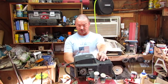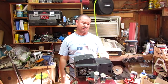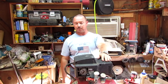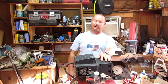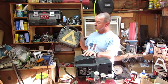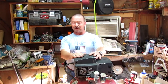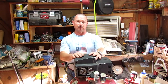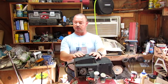And it cost me whatever the compressor cost me about 10 years ago when I got it. It was used in construction; I used it on a construction site to run nail guns and things like that. But it's been sitting for about 3 or 4 years, and I had seen videos on changing compressors into vacuum pumps, such as this one. And it did work really well, but it would only get down to about 8 or 10 inches of mercury, because the pump was actually bad on it. The ones I saw on YouTube would get down to 22, 23 inches.